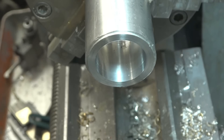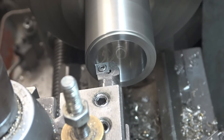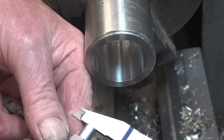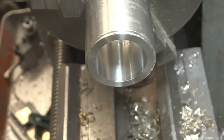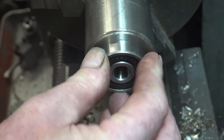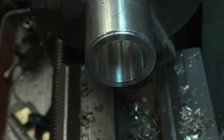It's still a few tenths tight. Getting 36.8 according to the micrometer — we'll go again. Now getting 36.9 according to both the vernier and the micrometer, so I'm going to settle for that. There's a little bit of heat in there, not much — that bearing will undoubtedly knock into there. I don't know how he's going to get them out when he presses three bearings in, but somehow that's not my problem. Next we're going to machine that outside diameter, which I think was 45mm.